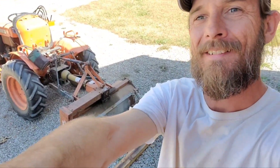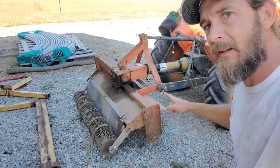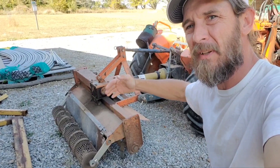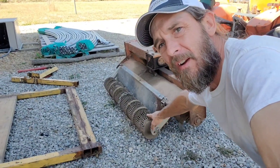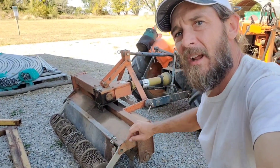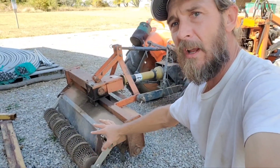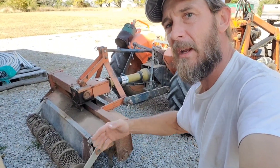What we have here is our little mini tiller on the back of our little Kubota tractor. It's a four foot wide tiller — it tills out about 40 inches from side to side. I have a roller tamper here on the back, which is actually used for concrete to smooth the tops of the beds, and then a little cowl to kind of knock the soil flat. We ideally only want to till about two inches, but the problem is that this guard in the back is catching up on the roller and causing it to stick and drag. It's also pushing the dirt out into the paths and we want to push it back in.